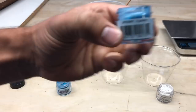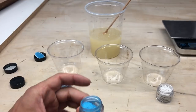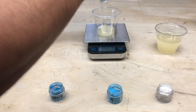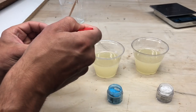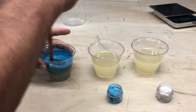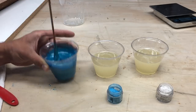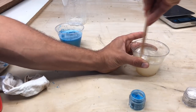Now comes time for the fun part: the color. We're using three different types of coloring pigments — I'll leave a link in the description on where to purchase these. I wanted a variety of color with more of a layering process to give it a cool effect when it's all said and done. I evenly divided the epoxy into three different containers and put about a full teaspoon of pigment in each cup. Using a stir stick, vigorously mix the pigment into the epoxy. This pigment is specifically made for epoxies which is why it doesn't clump when you stir — very important because no one wants lumpy clogged-up epoxy pigment.